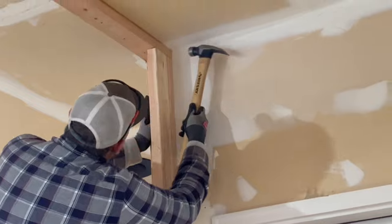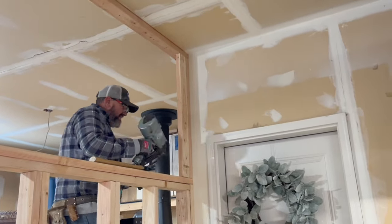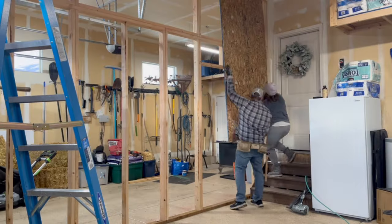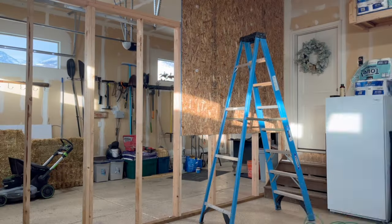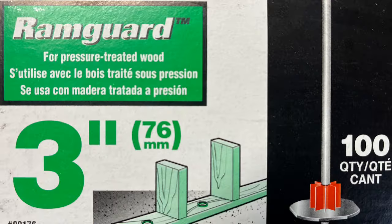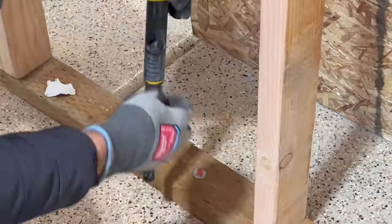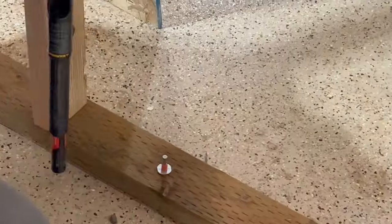Some backing for our sheeting. All right, we are ready for sheeting — all the 2x4s are framed and we've got some OSB. I think it's a lot stronger, about the same price, and it's less work. I don't have to mud and tape a bunch of drywall. Ready to shoot down the base plate — got some concrete nails. The code on this is every four feet, but this is just a dividing wall.